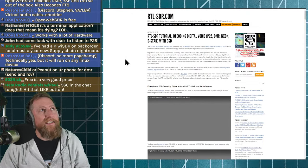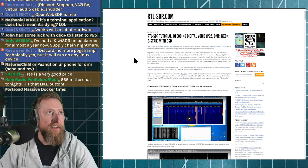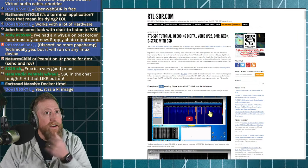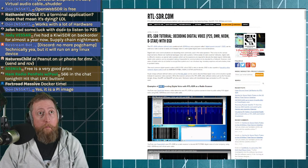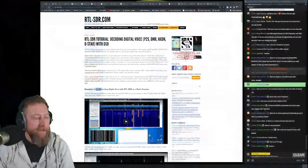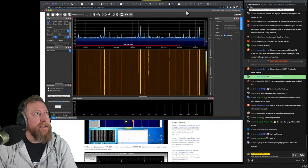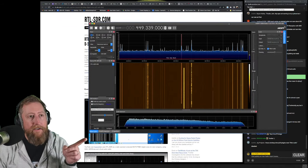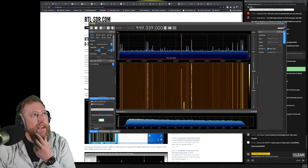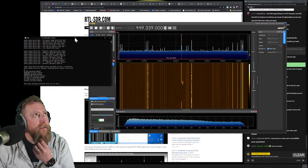All right. Okay. So there's another link in the description for RTL SDR decoding digital using DSD Plus. So to do that is a bit more of a pain, but I'll show you how it works here. So you bring back up your guy, and I've got it right here. This guy is the interface setup. It is a terminal that pops up when you click start.